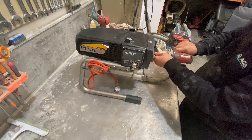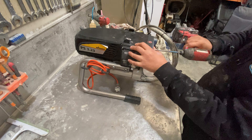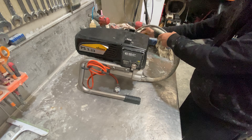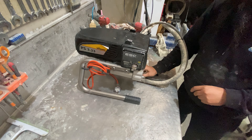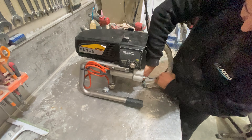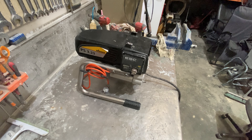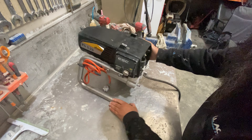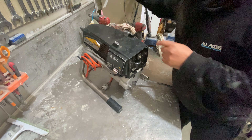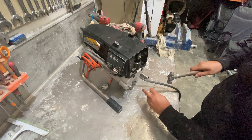There are four screws in the front. I'm going to remove the suction hose first — that's all it takes, sometimes it needs a bit of a knock. I'm going to drop the pump next, but before I do that I'm just going to drop the suction hose retainer.